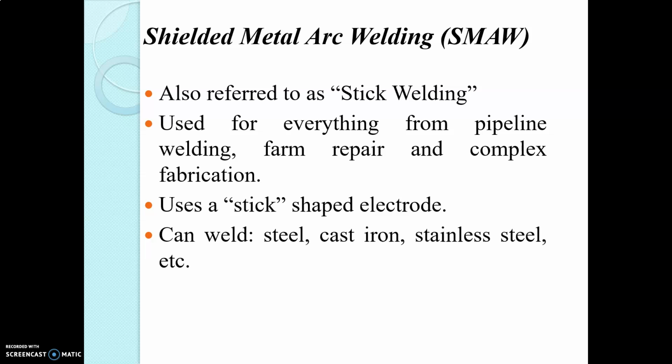The coated rods do not only supply the fluxing agent, but they also fuse at a lower rate than the rod itself. This property acts to exclude the atmosphere in the vicinity and prevents the absorption of large amounts of oxygen and nitrogen, which are harmful for the welding process. Because of this, welds made with the shielded arc welding process are strong compared to the unshielded one. The joints are strong and free from blowholes.